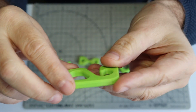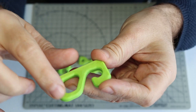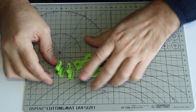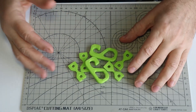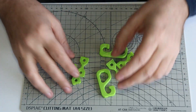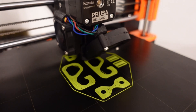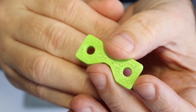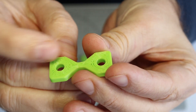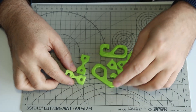The side walls are perfect and also the top layer. The bottom layer is not so nice because I used a smooth sheet, but it's quite acceptable. The next group is printed at 80% flow rate. During printing I didn't have any problems, but I noticed the first layer is quite ugly and weak — I can see quite big gaps. That's a low value but I was curious.